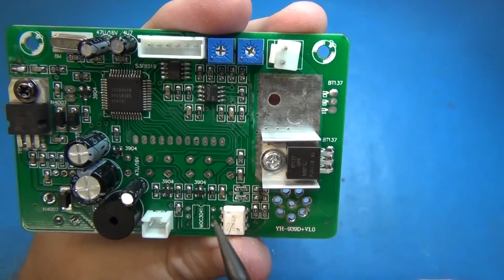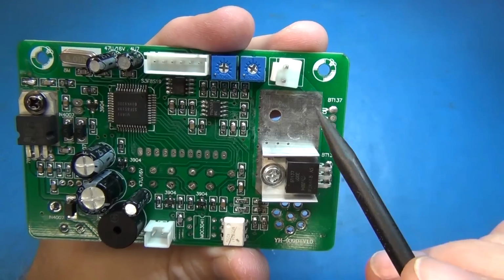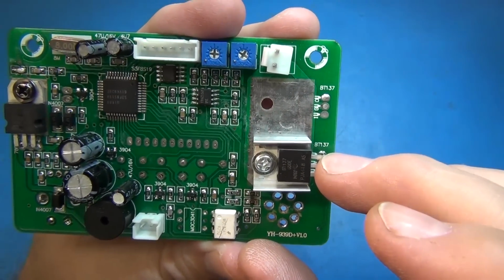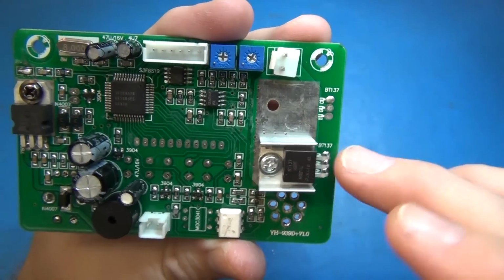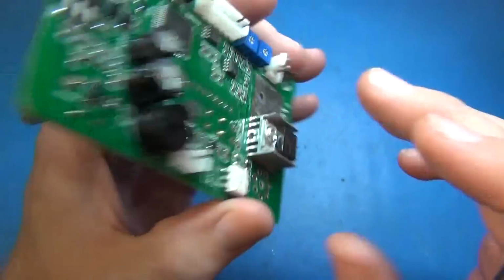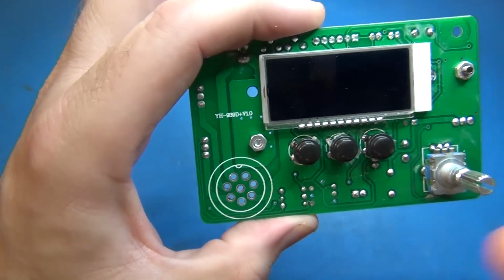So maybe they are getting a little bit cheap here by pulling down and dropping one of the control opto isolators and one of the Triacs, and just hoping that this isn't on solid all the time. It only would be on solid when it first ramps up, after which point it's going to be pulsing. So maybe they did enough testing to know that this was over-engineered, and they just dropped those two. Or maybe this second one does not tie to the same heater at the wand, but you think it might.